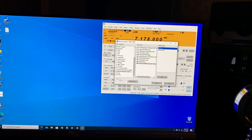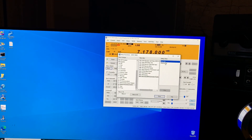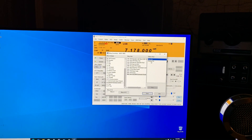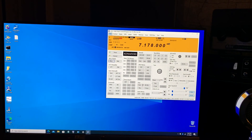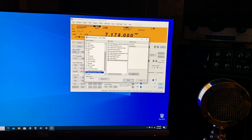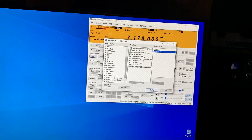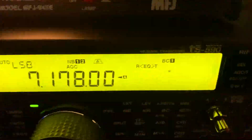Accessory — here we go. See, that's the normal drive out. People use that and they run it through an amplifier to get the MF or LF frequency out — that new ham band way down low. There's actually a harmonic when you're on 20 meters, and you can amplify that and work that other band. So you put it on antenna output — see what it does is it changes that antenna out. If I put it back to drive out, look what happens — it says drive out again. So what you have to do is put it on antenna out to make it work properly. Now it says antenna out — it changes what the button says. You want it where the star is on, which means antenna out.